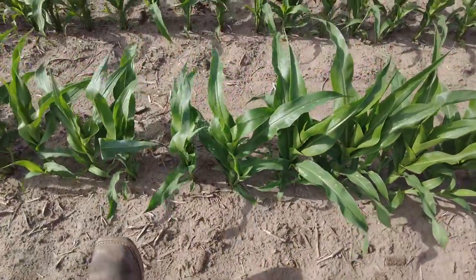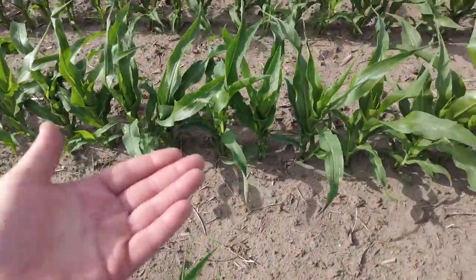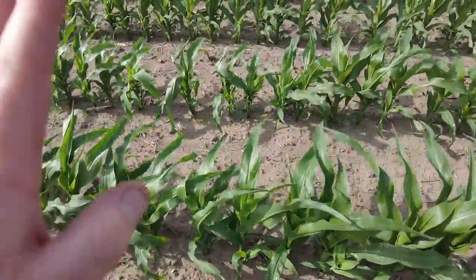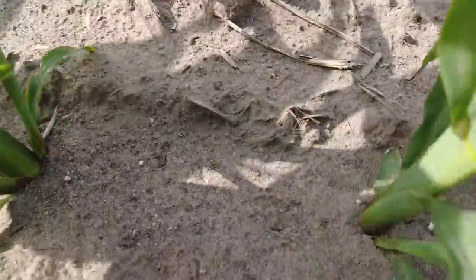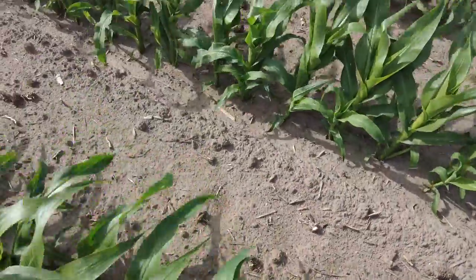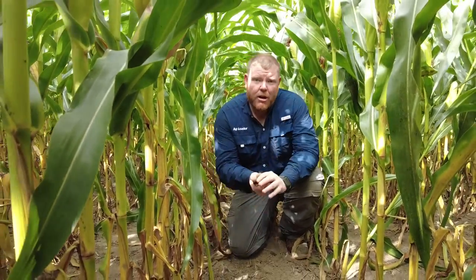This is one of the major values of the SureForce system: when we get to lighter or more mellow soil, it can uplift; when we get to harder ground, it can push back down. Here we've got sandy soil — very mellow conventional till. With sandy soil, no matter how hard we squeeze it, we can't cause compaction. But 100 yards behind me, the soil switches to clay, and now compaction becomes a concern that SureForce can help us deal with.